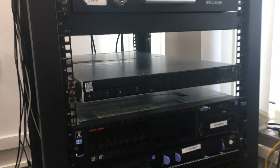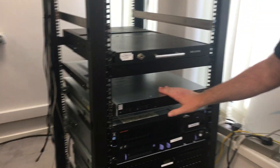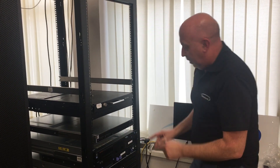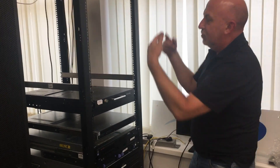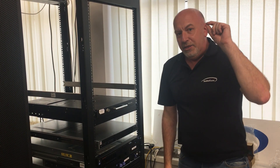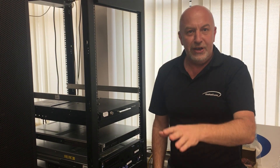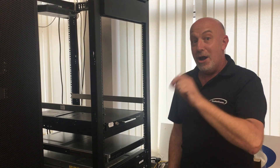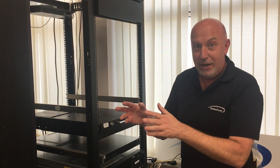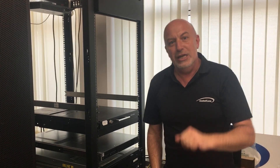Once it's in, put a screw in that side and a screw in that side just to lock it in place. It shouldn't be going anywhere — these are quite heavy. So again, once it's in, you can service everything, be it the discs, the power assembly at the front, or the nodes on the back, from front and back. You shouldn't need to take them out. The message you need to take away is: if you're using an IBM rack, you can use fixed rails — they're easier to put in. If you think you might not be using an IBM rack, then buy the variable rails so that it will work in an IBM rack or a non-IBM rack. Mr. Apple, I hope that was useful. See you next time. TTFN.